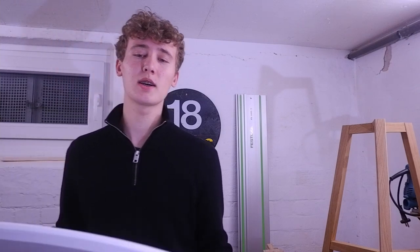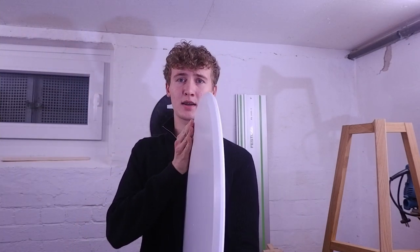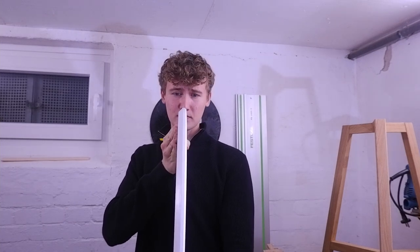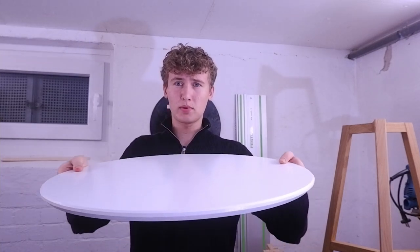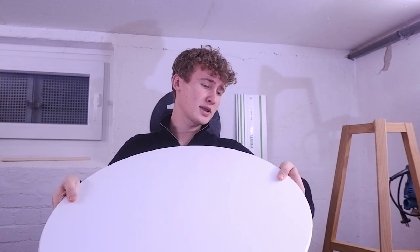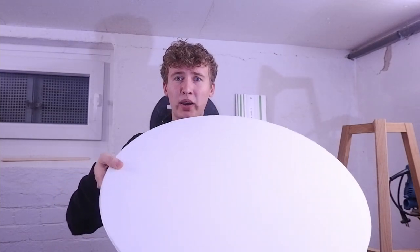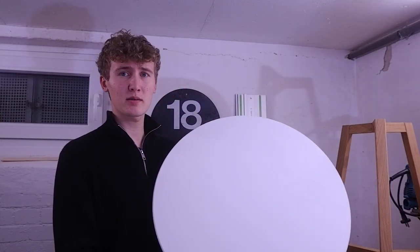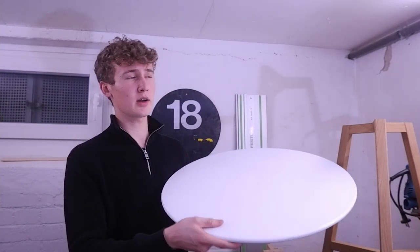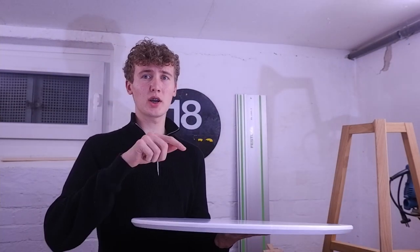And for the tabletop, I used a 45 degrees router bit and put a chamfer on both of the edges, so the tabletop doesn't look as thick as it actually is. It looks very slim and nice. And I also painted it white, so I think it matches pretty well with the natural oak color. And yeah, now I'm just gonna attach the tabletop with the frame.